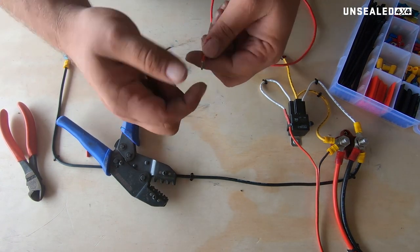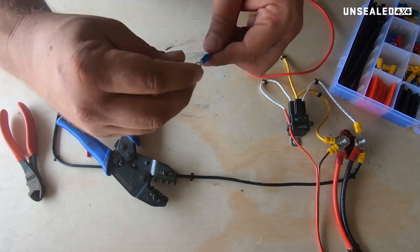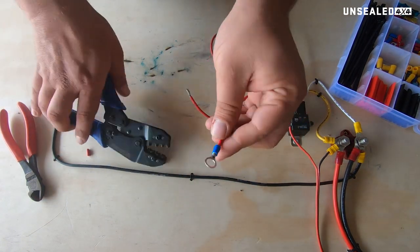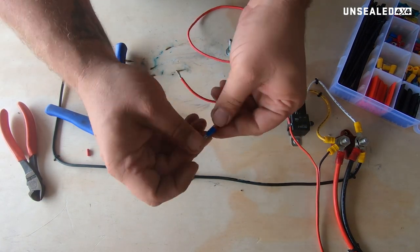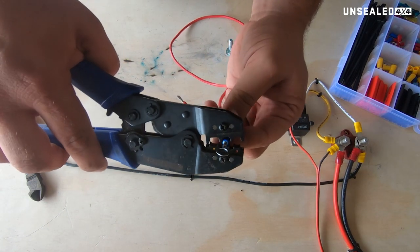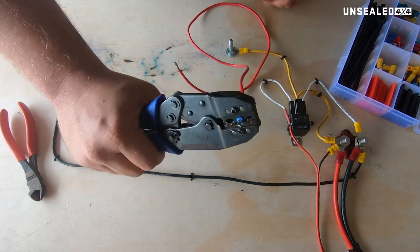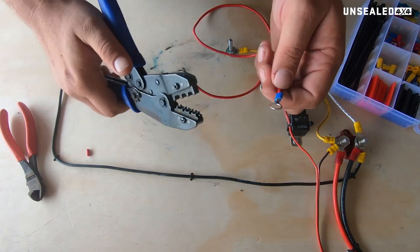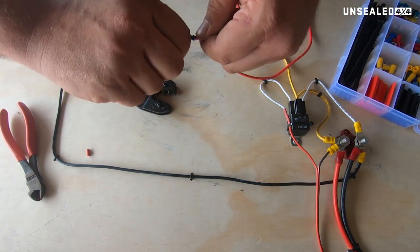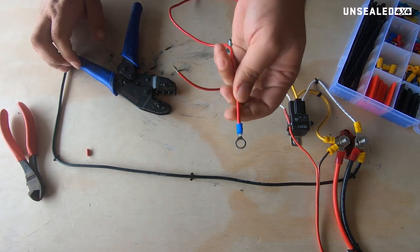So, let's get the wire into the terminal. Give it a little twist as it goes down so it pokes out the end just a little bit. Make sure obviously we've not got any bare wires showing out the back side of it. Then start to crimp — crimp it till it closes, give it a couple of squeezes. That's not going anywhere. Give it a good pull; you should not be able to pull that off. Give it a good yank — it won't go anywhere. That's the whole point to it.